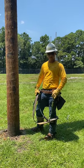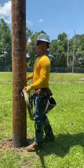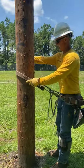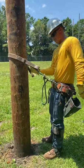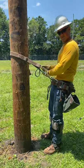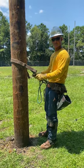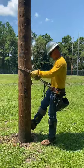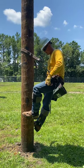Now we've tested our pole and got all our equipment on — we're ready to start climbing. We're going to attach the buck squeeze to the pole, wrap it around like this. This brown strap adjusts to the pole — you want it tight. You want your green rope to be tight to the pole, that way if you do fall, you don't hit the dirt. You can put your elbow to your stomach to adjust how far you need to be from the pole. Take your first step — you don't want to step too close to the center, kind of be on the outside of the pole. Move your buck squeeze up and take your next step. Whatever leg is on the farther end, you want it locked out.